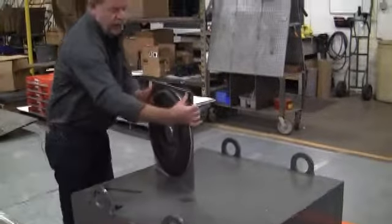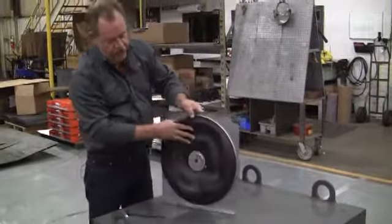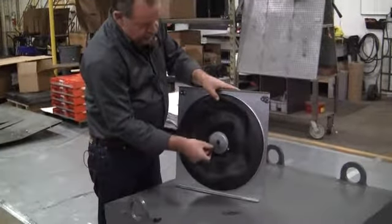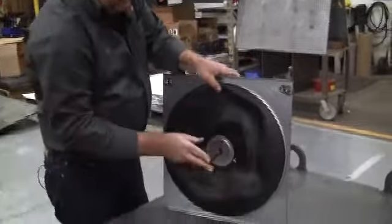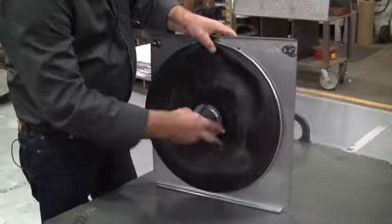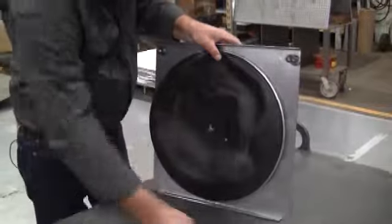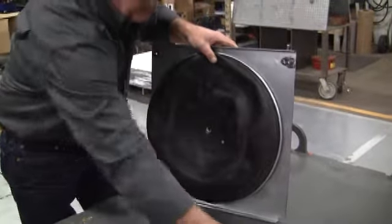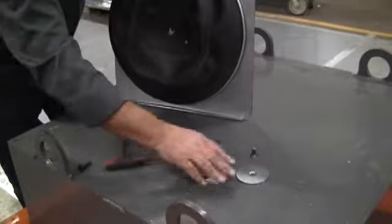Once you've removed the air bearing and its tray, you can change it by completing the following. You will remove the flathead bolt that retains the bearing to the tray. The attachment consists of a 3/8-16 flathead bolt, a large washer, and a smaller washer.